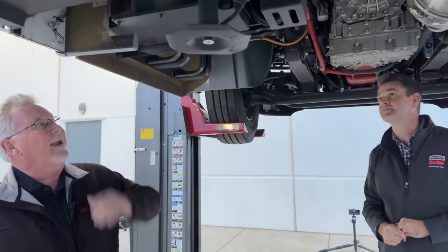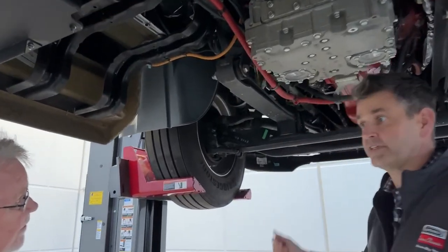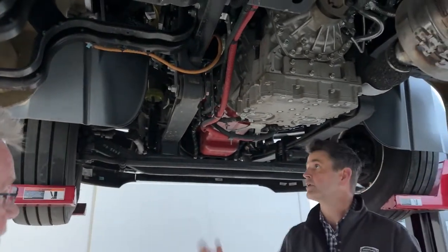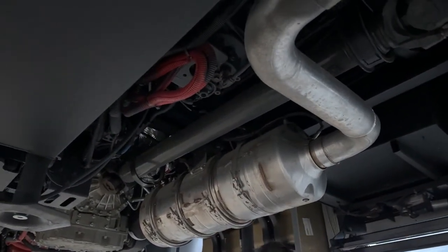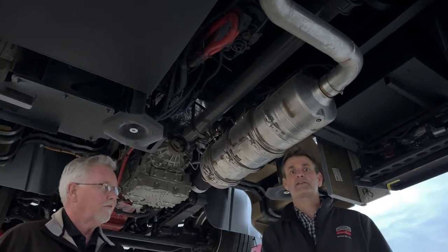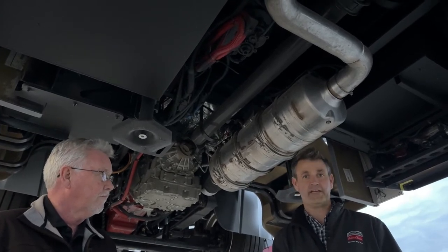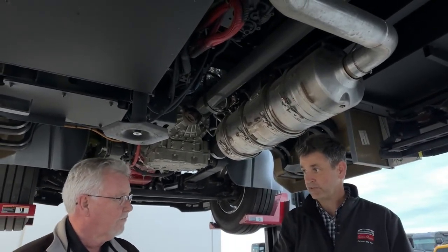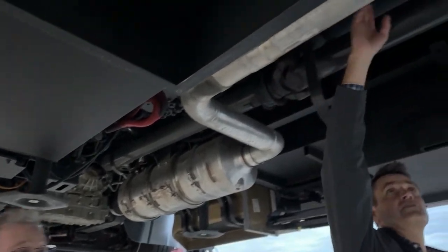On the side of the engine there's an air compressor. We talked about air ride in the rear and air brakes, and that air compressor feeds back here to an air dryer. This air dryer has a filter on the top that needs to be replaced every three years. A lot of customers neglect the air dryer filter — use the app so you don't forget. The air dryer cleans the dirt out of the air, keeps it dry, and feeds that clean, dry air into the air tanks.